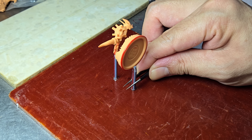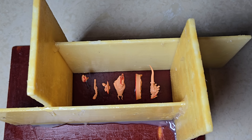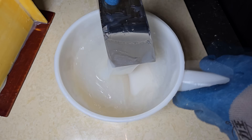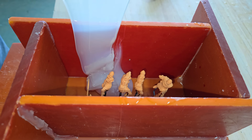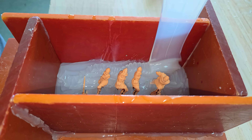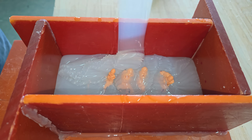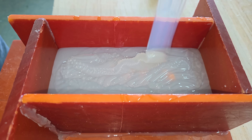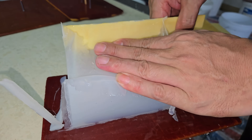They're not ready for a metal mold yet. First, they make a silicone mold to produce a few copies in two-part casting resin. The 3D printed masters are carefully positioned and framed up. Liquid silicone is mixed with an activator and poured into the mold box. Soft silicone molds like this are usually capable of making about 20 high quality copies before the mold starts to degrade. For some clients UniCool produces cast resin miniatures as the final product, but here the goal is just to make a few high quality copies as production masters.